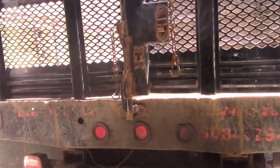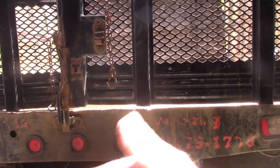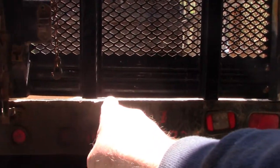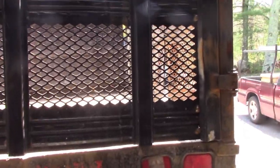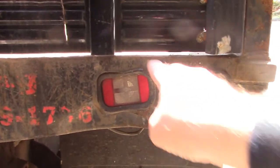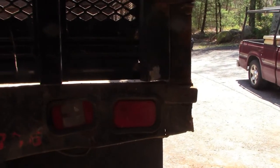This truck has 8-inch high channel iron vertical supports that run forward, and that's what the hoist is connected to. But from the connection point of this body all the way out, the only strength it has from that very strong vertical 8-inch channel to the outside is this formed sheet metal. As the heavy loads, and particularly the corner post, get damaged or bent or flexed, you can see that even the holes that were created to mount the taillights are collapsed and buckled all around because of the strength that's removed. The only real connection to these corner posts, which take a tremendous amount of abuse, is this sheet metal shape from here to here.